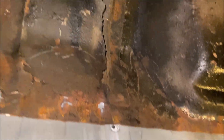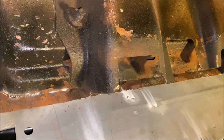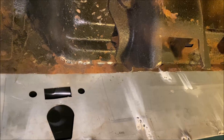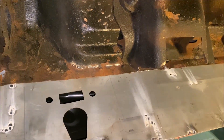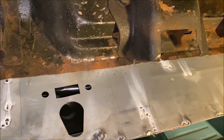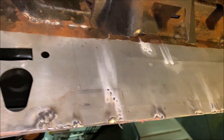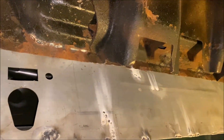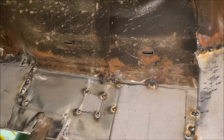It's pretty much the same on both sides, they're just as bad as each other. But this is definitely part of it - if you're going to figure that you have to replace the cab corners and rockers, really the chances are that these are also rotted off too. They're probably the first to get it. I'll show you guys what they look like and hopefully some of the process, and what they look like when we're done, because I've gotten some requests about this.